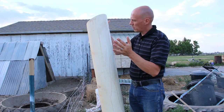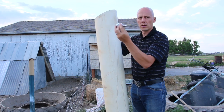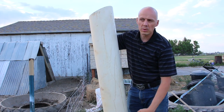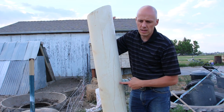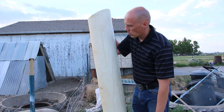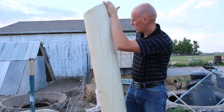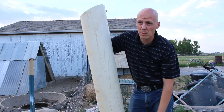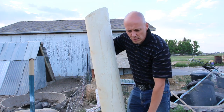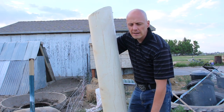The idea is we're going to use this PVC pipe — it's like an 8-inch PVC. We're going to connect a nipple waterer to it, and once we fill it up a little bit with concrete to keep it sealed, it'll hold about 10 gallons of water. Each one of these pigs should be drinking somewhere between a gallon to a gallon and a half of water a day, which will make this last a day, day and a half maybe. We can fill it up once a day. We're already filling the tire two or three times a day because they just dump it out. So we're going to dig this down a little bit so they can't tip it over, fill it part way with concrete, drill a hole for the nipple waterer, and then we're done.